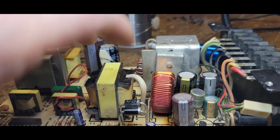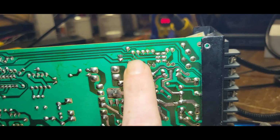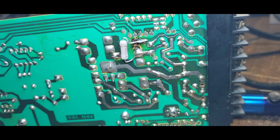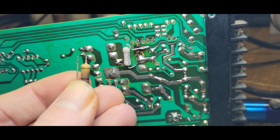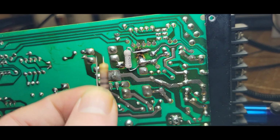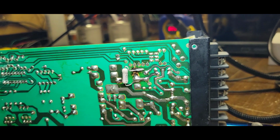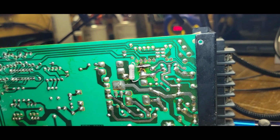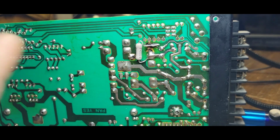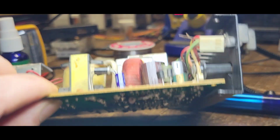And changing that, but the main thing is changing that resistor to something that, you know, is not so burnt up. Now, I don't know exactly what the wattage is of this, but it's close to the same size. It's probably a little modern, so it's probably a little smaller than this, which is fine. But what I'm going to do now is I'm going to put it all back together. I'll save you the trouble. If you want to see me put together a power supply, there's other videos on my channel, but I'm going to get this all together. I'm going to do a quick test just to make sure we don't blow anything up.